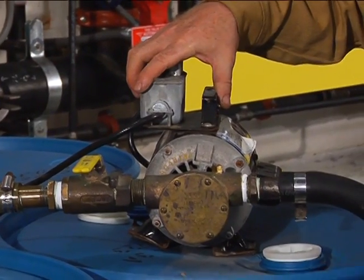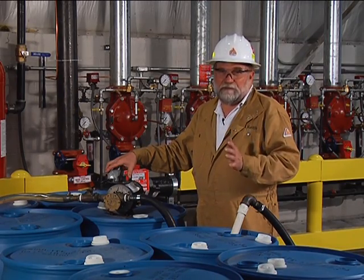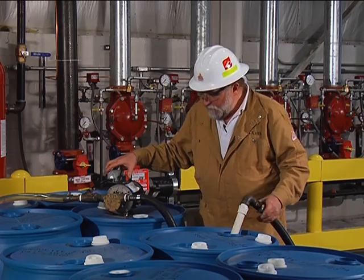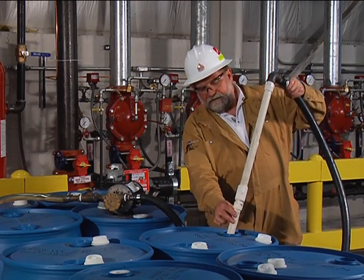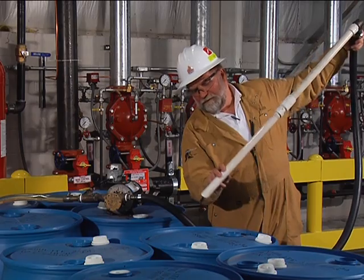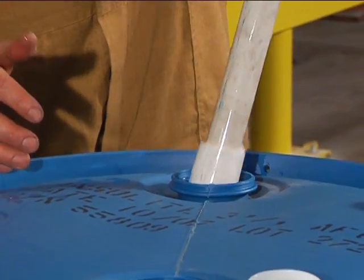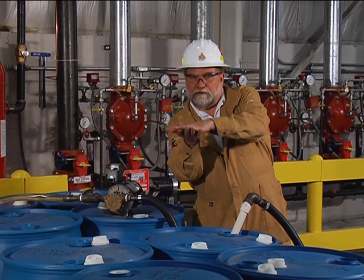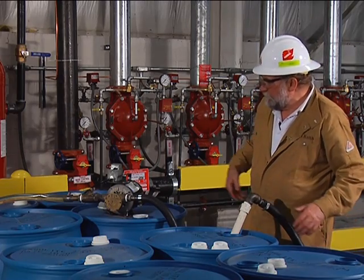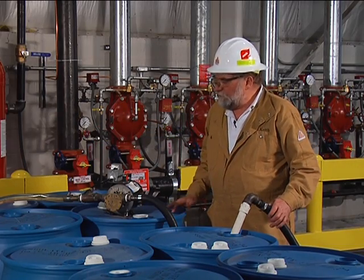This particular pump is high volume, low pressure. You should never use a hydrostatic test pump for filling foam tanks of any type because you may accidentally over-pressurize them. The arrangement includes a pickup tube with its end cut at a 45-degree bevel so that when inserted into the drum, it does not make close contact with the bottom, preventing problems with picking up liquid through the suction hose. It has a fuse switch connection and an extension cord that connects to a 110-volt power supply.